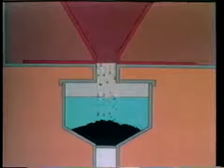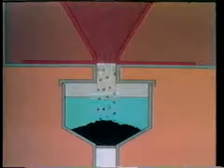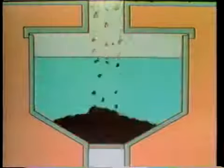The bottom ash hopper can have refractory problems caused by the bottom ash that collects there. The ash is very hot when it enters the hopper. Normally it is cooled quickly by water in the hopper. However, this water must be drained every once in a while to get rid of the accumulated ash. While the hopper is empty, hot ash can heat the refractory on the inside of the hopper. This problem is made worse by the sudden temperature change that occurs when the ash hopper is refilled with water. The combination of heating and then sudden cooling of the ash hopper can lead to spalling and cracking of the refractory.